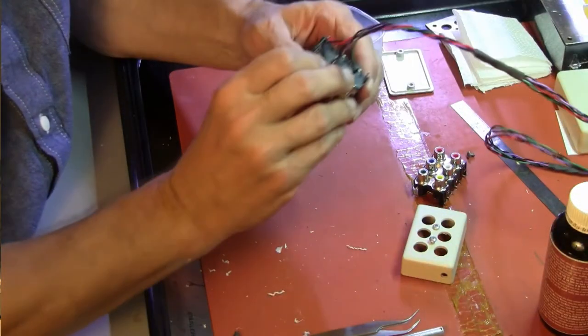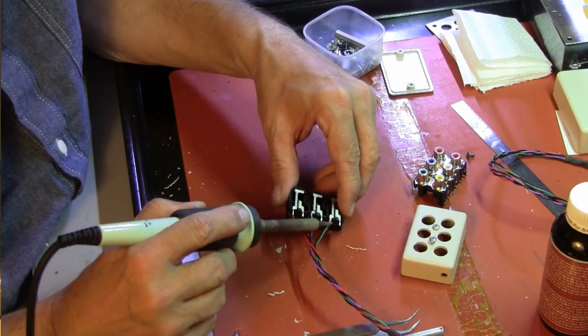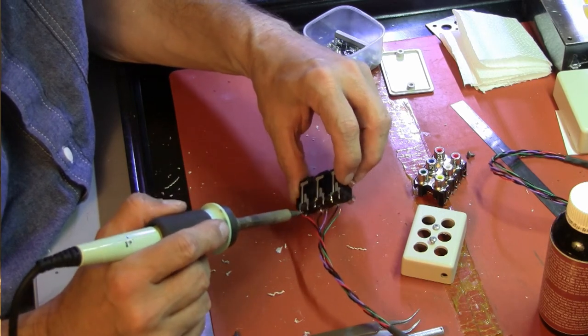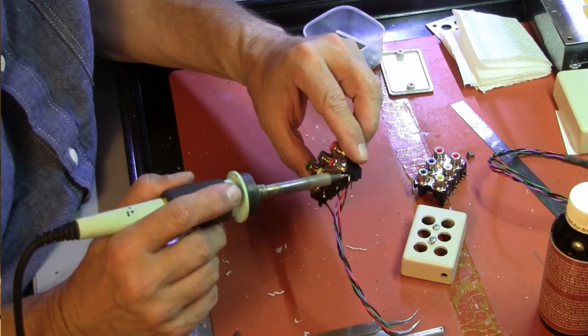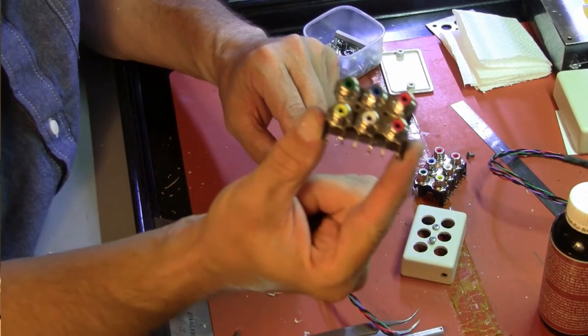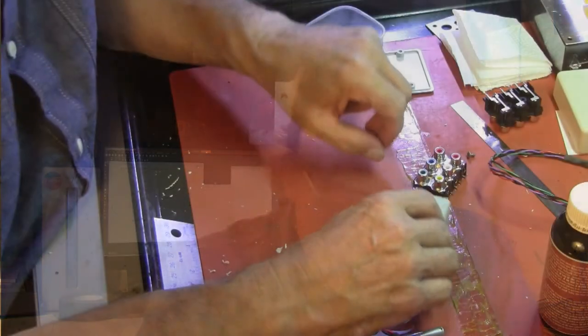Now we take the previous connector and remove the wires. Don't solder these onto the connector before putting them into the box. There we go — like it was made to go in there. The heat shrink just won't go in, and I was hoping it wouldn't. I want to drill it just a little bigger, because I want to put heat shrink where the wire passes through there as strain relief. I forgot to put the heat shrink on the cable.